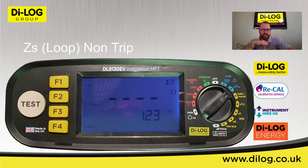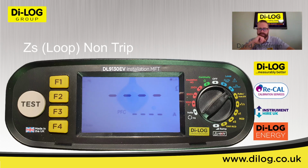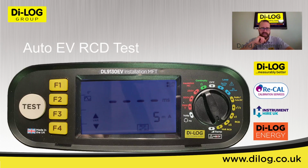There you go. A new feature we've introduced into the new 9130 specifically is RMAX as well. So this will track and automatically record the maximum loop testing as well. It's where we got the idea for RMAX from, actually. So you're going around the sockets, doing multiple loop tests on each one to find out the furthest point, so that you're really looking for the maximum resistance on either a radial or a ring main to record your ZS. You can see 0.26, and it takes a couple of seconds to capture that as well.